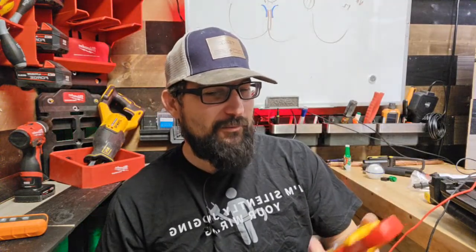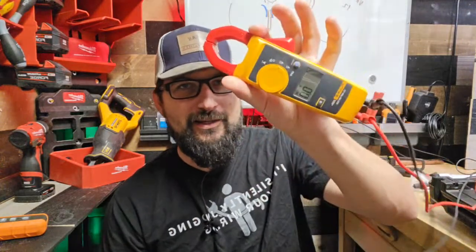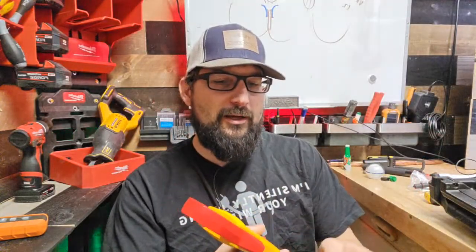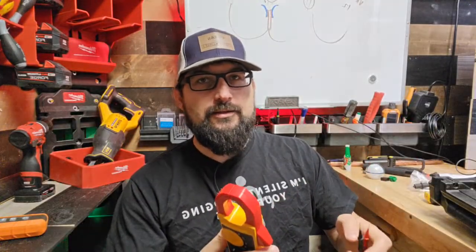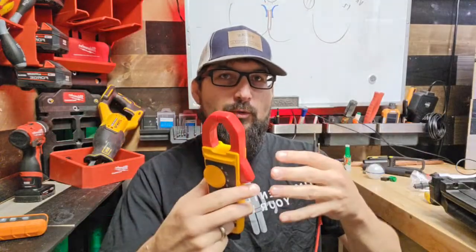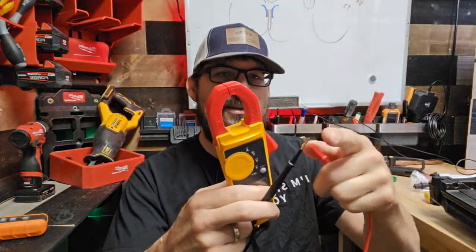You're good to go. So I was like, oh, okay, well, it can't be that box. And then after finally circling back, I was able to push this plug hard enough against the metal box that I could get this thing to beep. But really, this thing started beeping in continuity as I got closer to the problem. When I first went to the first plug in the whole line of the circuit, it said, nope, everything is clear. But then, as I started getting less and less resistance through the circuit and got closer to the source, this thing actually started making noise on continuity, which it does.